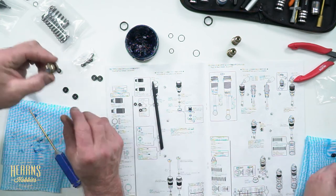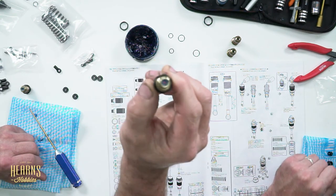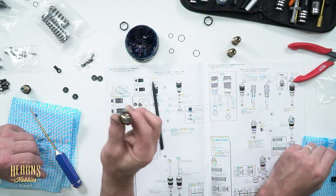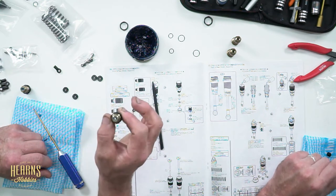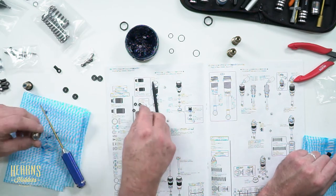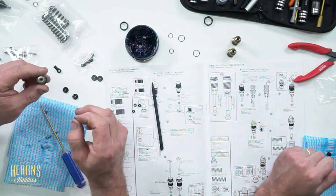We've got the O-ring, the first one in there. It's got a nice coating on the whole O-ring. The first one's the important one, because it has the silicone oil sitting on top of it. So it's the one that cops all the oil, and it's the one that swells the most of the two.